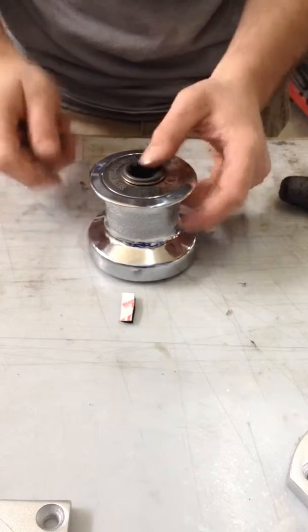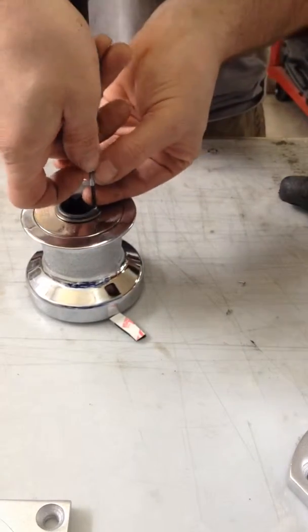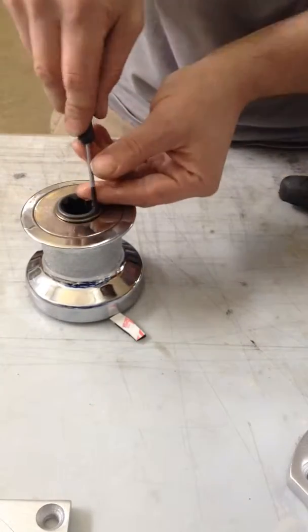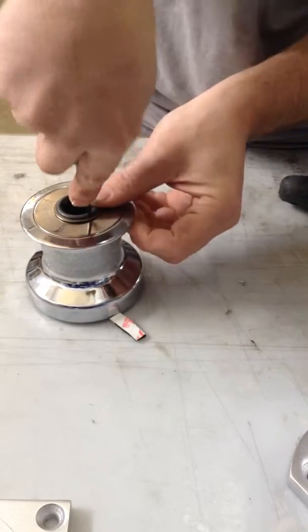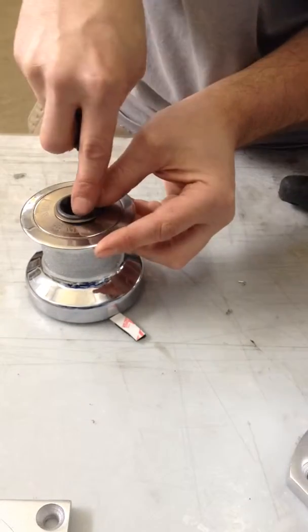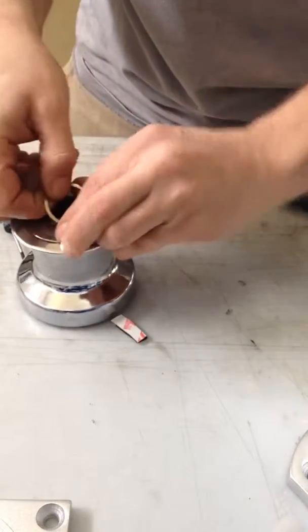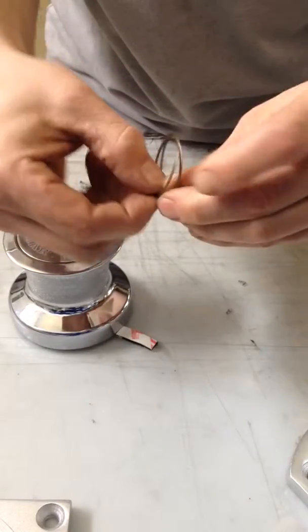The first step is removing a little locking spring-loaded retaining clip here. Just use a small slot screwdriver gently so as not to scratch the chrome. You're going to stick it into the tail and pry it out as so. Your finger will then work its way around. There's the retaining clip here.